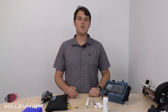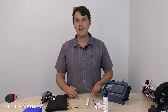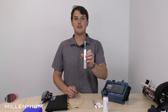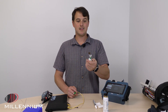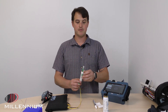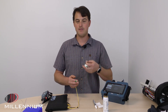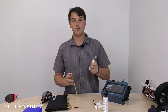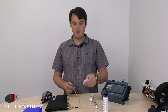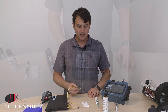When cleaning connectors, first and foremost start with the dry clean — just like cleaning windows in your house or your windshield. If they're not all that dirty, start with a dry clean. You can use a one-click cleaner; they typically take three or four or five clicks but do a pretty good job and they're fast. They're versatile too — you can do a jumper or take the cap off and go inside a patch panel. Another dry method is using a lint-free wipe and swiping the connector across it. Cletop also does the same trick.